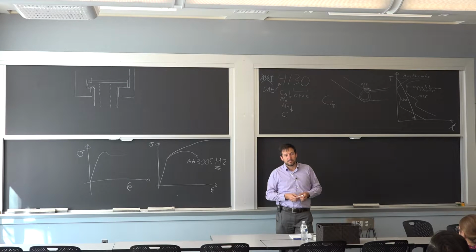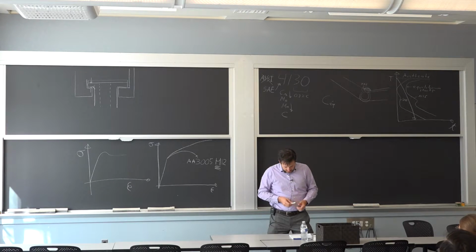Just the chemistry. It's nice, because if you had to also analyze whether it was cold form, hot form, what kind of grains it had, it would require a lot more samples. So all we had to do is get some chips from drilling a hole. That's all you need to do the chemistry for that.